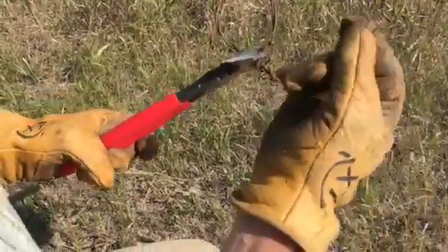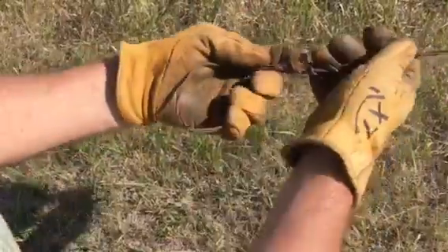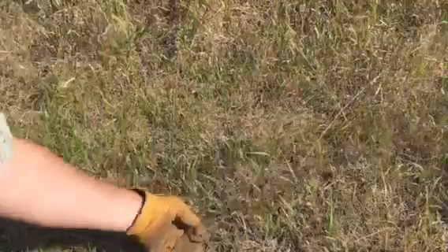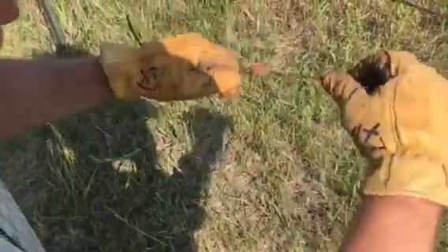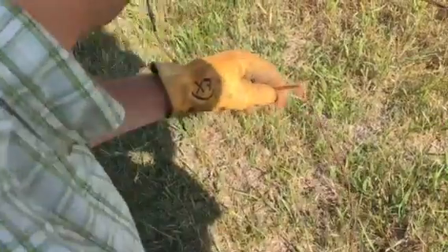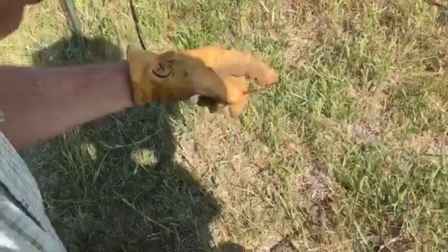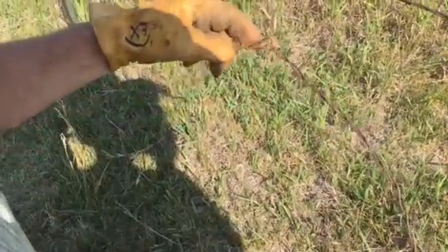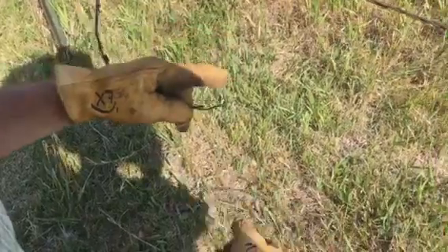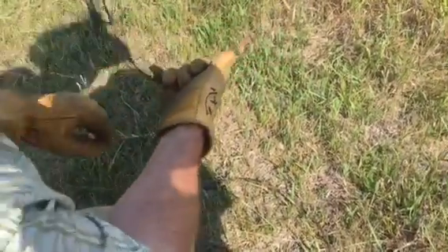So at that point you've got your big loop on one end. You can see how bad the barbed wire is — this was already broken, so I have one strand holding that piece of wire together. Really it just needs to be replaced. But something that close to an end, just cut that off — it's just gonna break anyway. We're gonna put the same kind of loop in this end again.